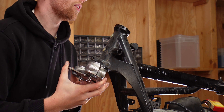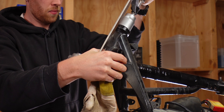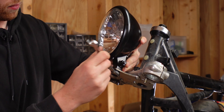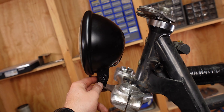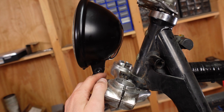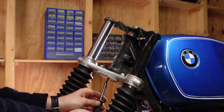This top bearing is a press fit so I hoped I could get it back in just to see how it looks — and that worked pretty well. Looking at it from the front, I think I have to make a slight adjustment because the gap is too big and it sticks out too far. But the good thing is there's still a lot of room, so I can just drill a second hole, move the bracket a little bit back, adjust the radius, and then we should be good.